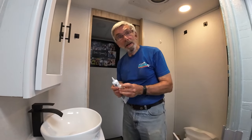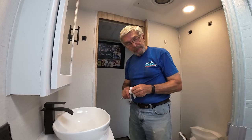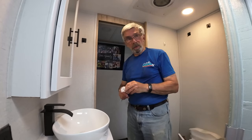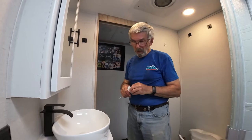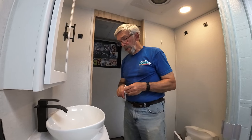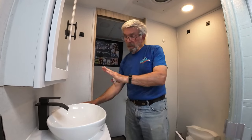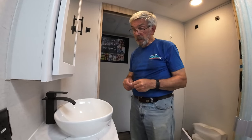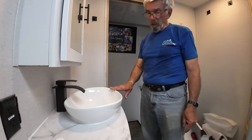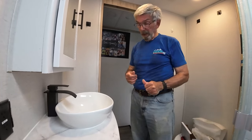Dave, on a scale of one to ten — difficulty for somebody doing something like this? It's not that easy, mainly because if you are not semi-skilled with a router, you're in trouble. You can't cut these out by hand with a saw, and even with a small jigsaw you wouldn't be able to get around in here properly. So I would say probably an eight. Replacing the faucet alone — that's a three. Taking the original sink out — that's easy. But cutting a hole for these vessel sinks with no templates, basically doing it by hand and guesswork to get it to fit — that's the hard part.